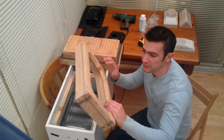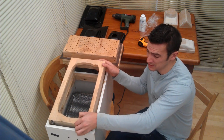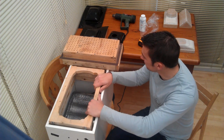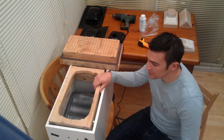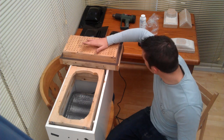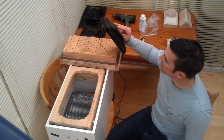The laser infrared thermometer is quite handy but not really essential. You could literally build a frame and put it in your oven — that would actually heat the plastic more evenly. This setup is just handy because I can use it in my garage or conservatory. I'd really recommend using seal strips because it vastly improves your vacuum efficiency — you don't want to be losing any air from anywhere.